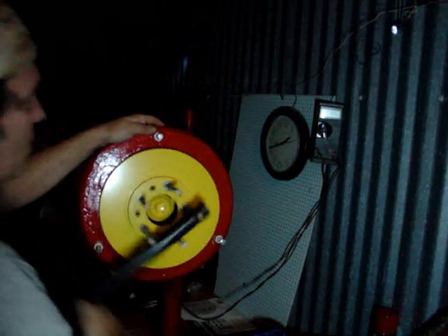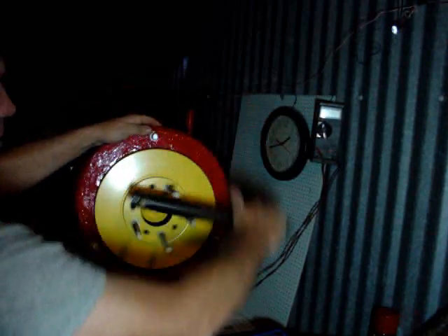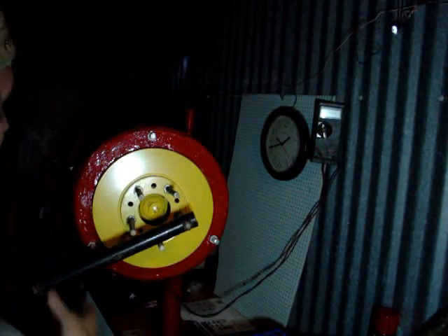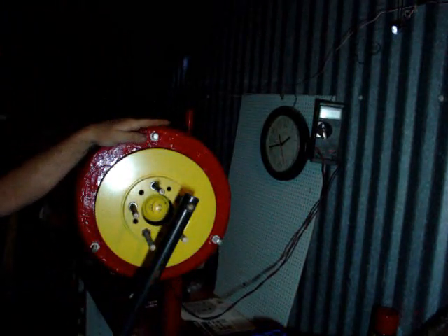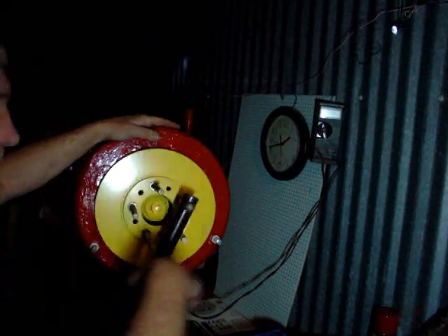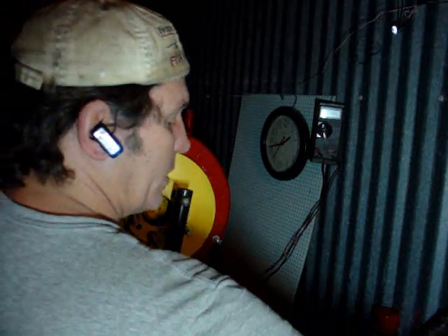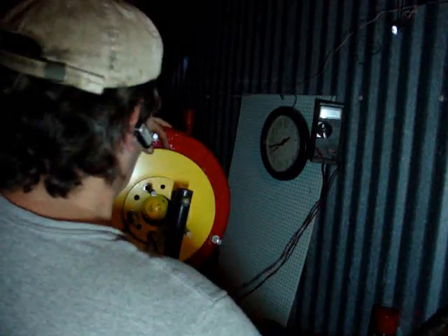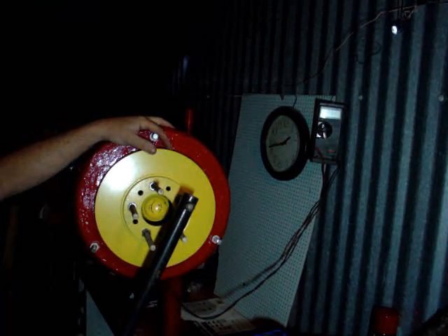Pressing it like this — if I put about this much torque I can keep about seven to eight amps. Short it out. This is not about voltage — you're not talking about power. The pressure right here is what turns into amps. The RPM is your voltage. Getting your prop set to your alternator is critical. If that is not matched for battery voltage and RPM, the thing is going to turn in low wind but won't efficiently charge.